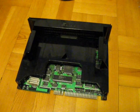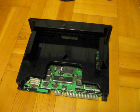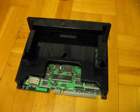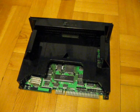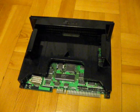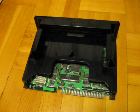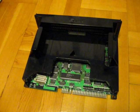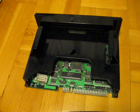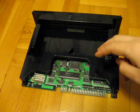This board here is the MV1A model. There are several different revisions of the one-slot board and they all look a bit different. This one and the MV1FZ look pretty similar — they have all the same components and the same layout. But a lot of the other variations of the board will look a bit different, so if you have one of the other boards this video might not be that helpful. Anyway, on this board the battery is located underneath the plastic casing here.